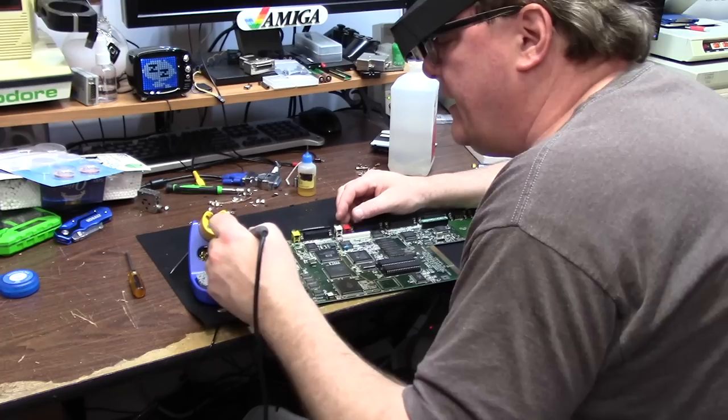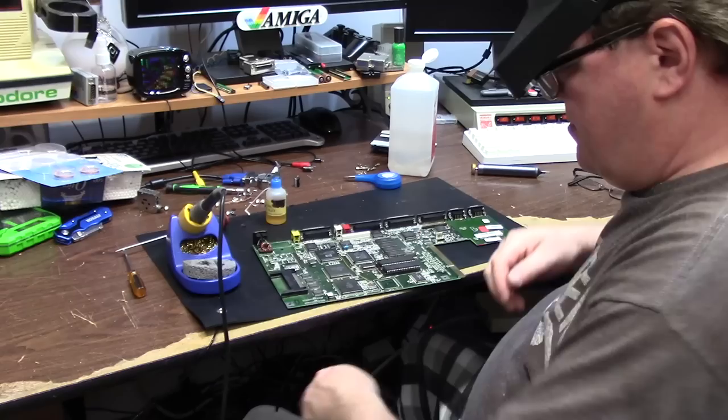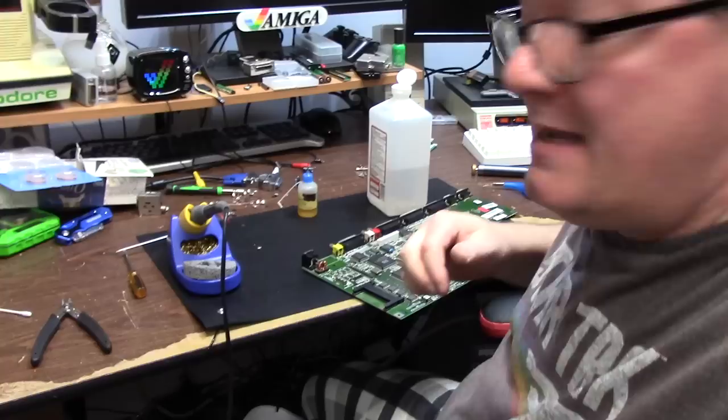So I'm going to debraid the ones I got out in a second. Another leaky one near the power decoupling cap. That's all of them, minus the keyboard one. Let me clean this up. And not a trace was lost. Let's go over the whole board.